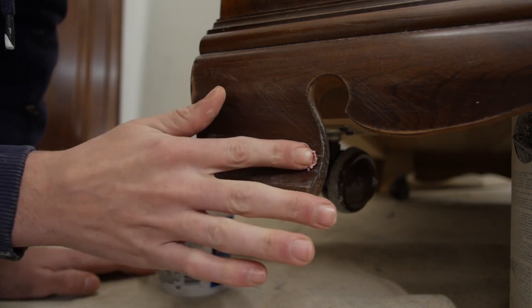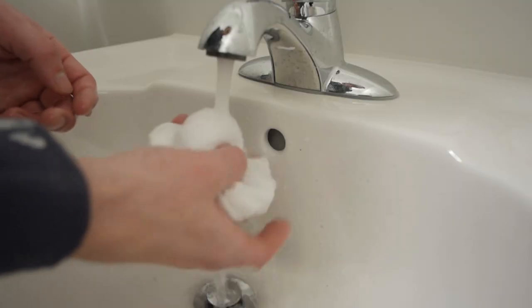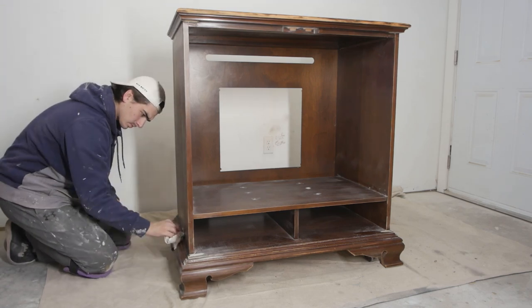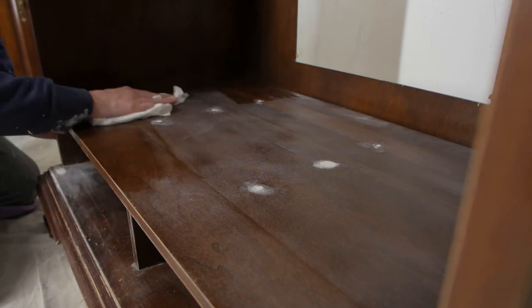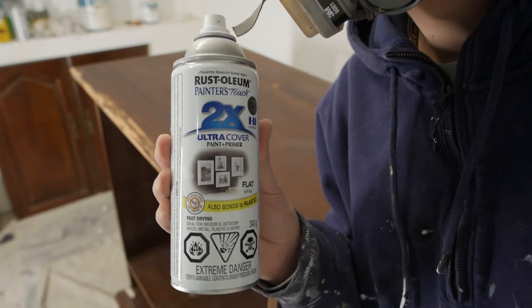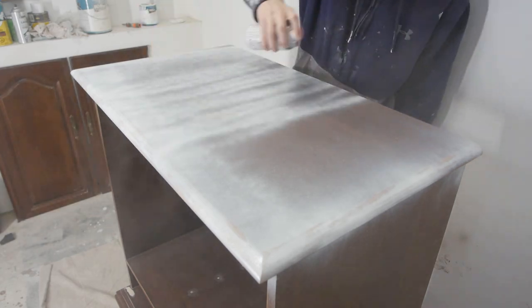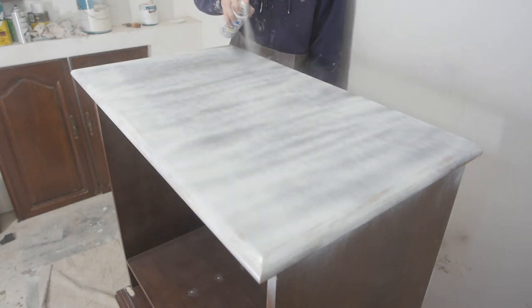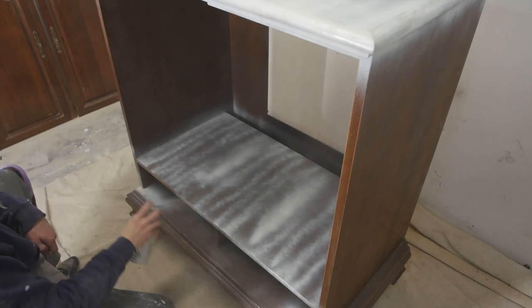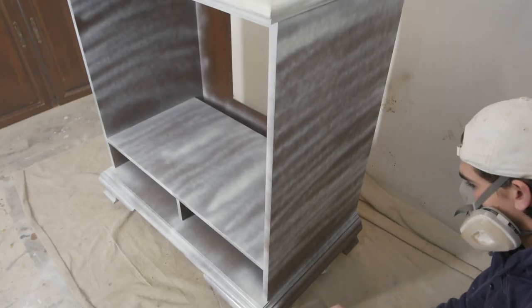I did end up putting some wood filler over the crack just so everything looks good in the end. I grabbed a damp cloth and cleaned up all the dust before getting started on priming. I'm priming this piece with Rust-Oleum Flat White. My original plan was to paint this a cream white, but after spending some time on Pinterest, I decided to go black. It never hurts to do a layer of primer anyway — it's just another surface that protects your piece. Do a quick sand with the 220 grit sanding sponge and it's ready for paint.